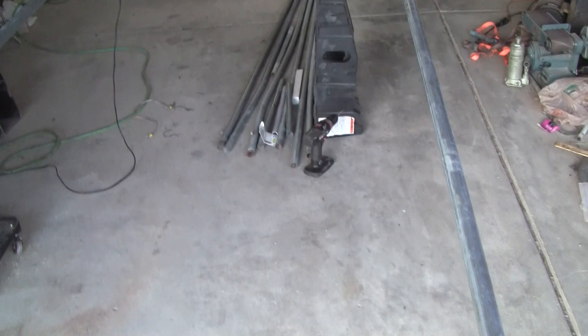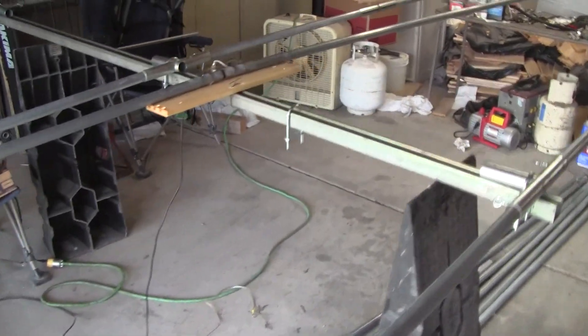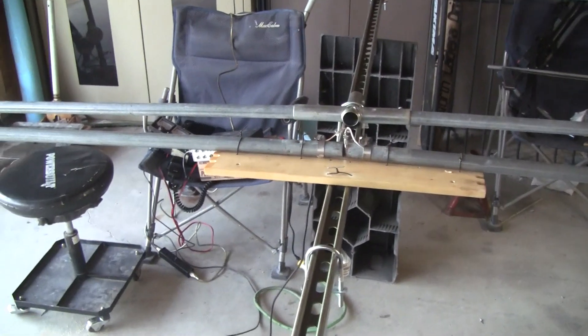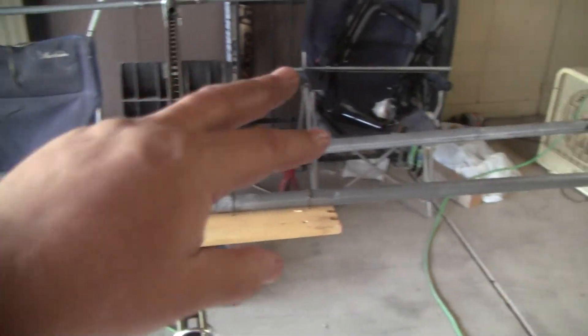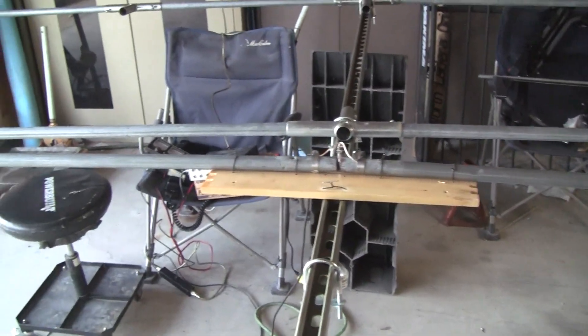This is just a ton of work — at least it's mechanically all put together. The feed setup is just tied with a piece of bailing wire and that's all that's holding it in place, so it's not stable. I breathe on it in here and it moves. One of the things I mentioned is that keeping these two elements parallel changes the bandwidth of the antenna massively.